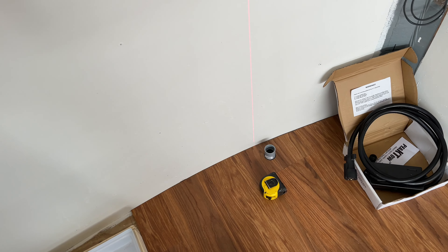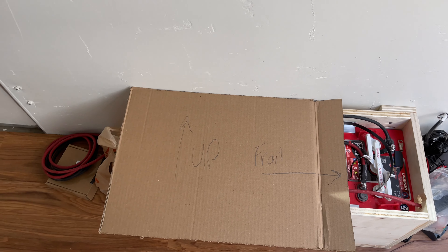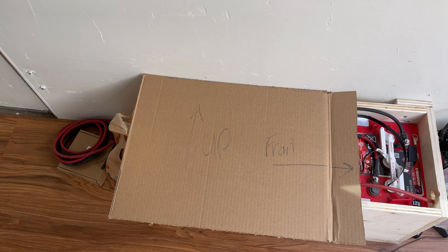To get the contour right, I cut out a piece of cardboard — this is 24 inches — and I'll use this as a template so I won't have to cut my plywood two or three times. I'll get it right the first time. Once I get that marked out I can just transfer it onto the plywood and put it up.